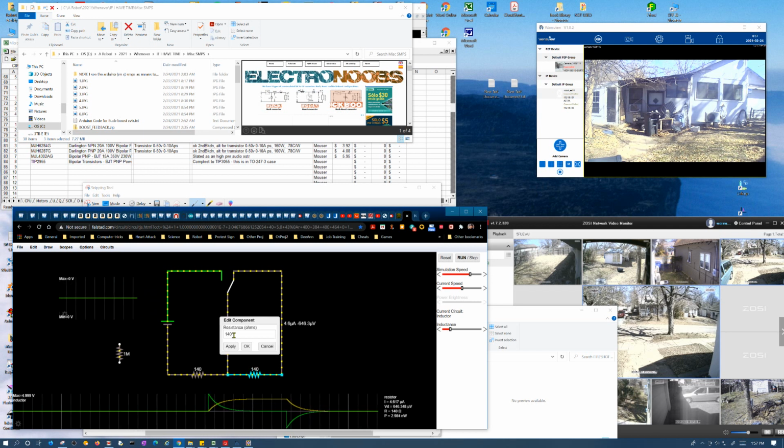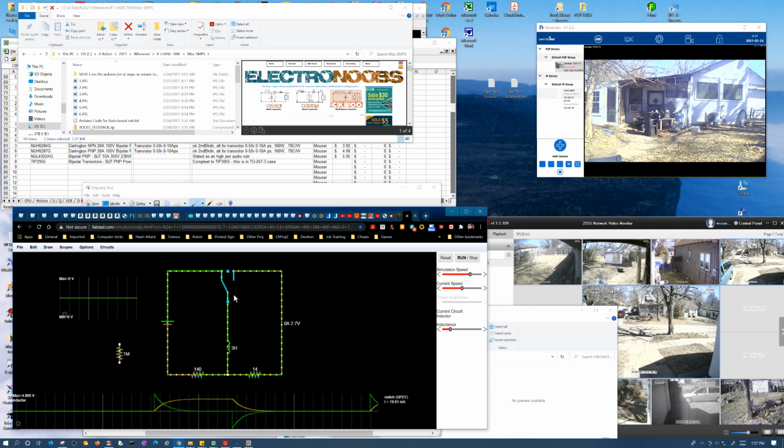Now, if I reduce this to 10% of the input and charge it up, of course it's going to take just as long, because this doesn't affect the charge rate. But I'm discharging into a smaller impedance, so you can see that it takes 10 times longer to discharge, and it comes out as a lower voltage. So you lose voltage, it's like half a volt or whatever, but you gain discharge time.